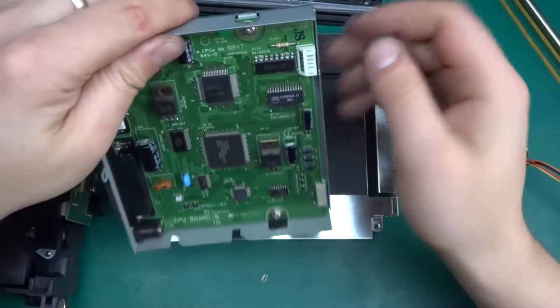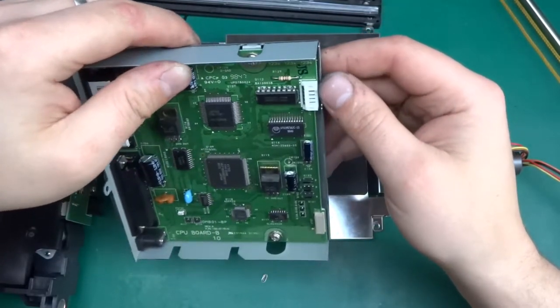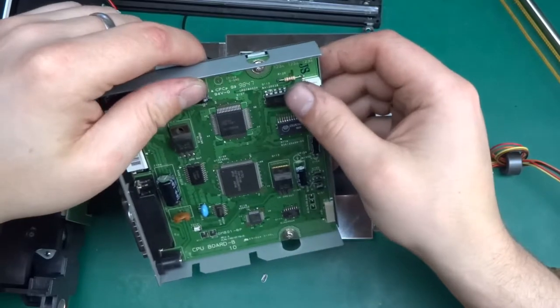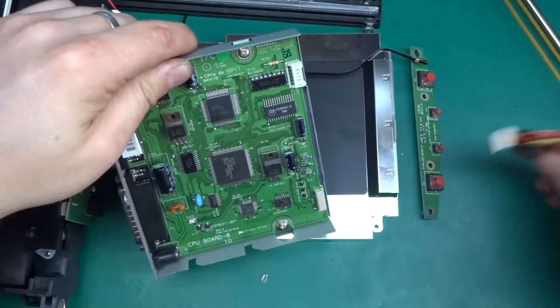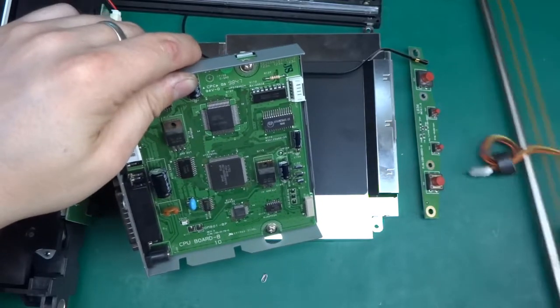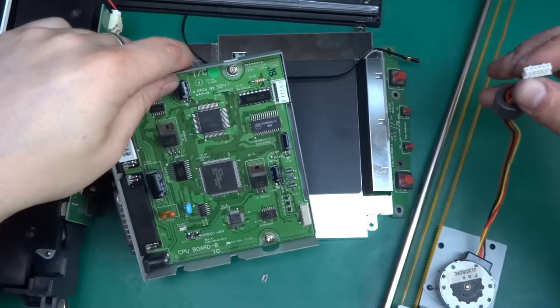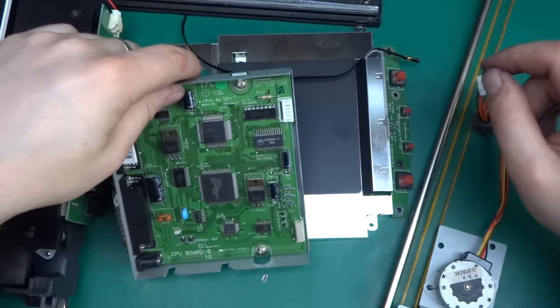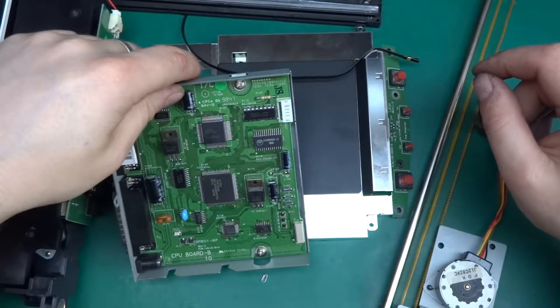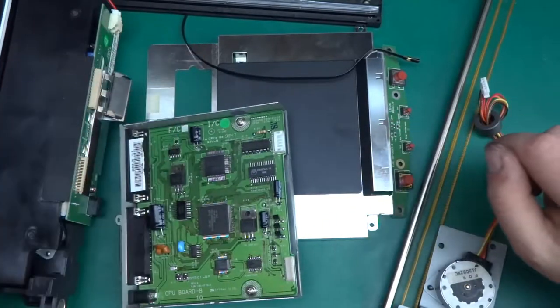And here there is a TD6200, 6203 AP. So I suspect this is some sort of H bridge or a stepper motor driver, because what have we got? Yeah, that's a 5-pin, so I suspect that's a unipolar stepper motor. Let's actually have a look. What chip is it?